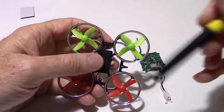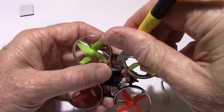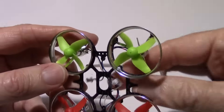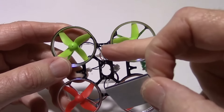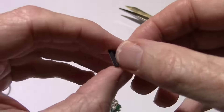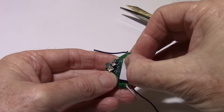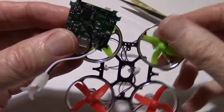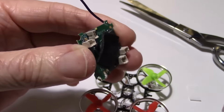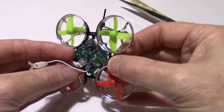We need to remove this piece of double-sided foam from the Raycon Heli frame. I'm peeling it back with an X-Acto blade. It looks like we just need enough to cover that little square piece in the middle, so I'll cut about a third of that strip off. The strip goes diagonally across the board — I'll put it on the board first, centering it on a diagonal. These three holes are the front of the Raycon Heli frame — whatever frame you have, just make sure the arrow is pointing toward the front.